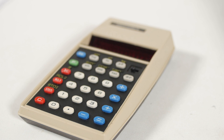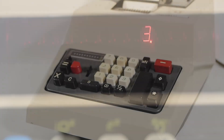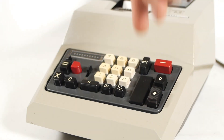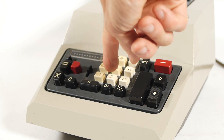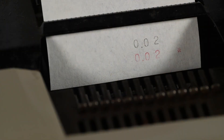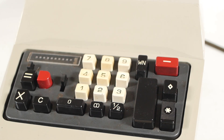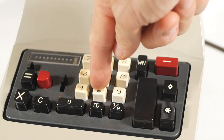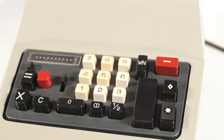As with most adding machines, you don't use it like a normal calculator. On a normal calculator, if you wanted to add 2 plus 1, you'd enter 2, plus, 1, and equals to reveal the answer of 3. But if I do the same thing on the adding machine — the plus key is this big rectangular key, with the subtotal or total key taking the place of the equals key — I'll enter 2, plus, 1 and press the total key, and I'm left with the answer of 2, which might not be what you'd expect. To use an adding machine, you have to add each number into the register or accumulator before pressing the total key. So if I press 2 plus and 1 plus, that has added both numbers into the register, and I can display the total by pressing the subtotal or total key. And we now have the correct answer of 3.